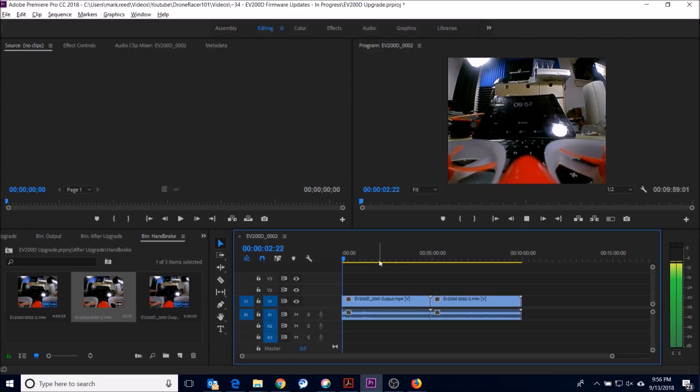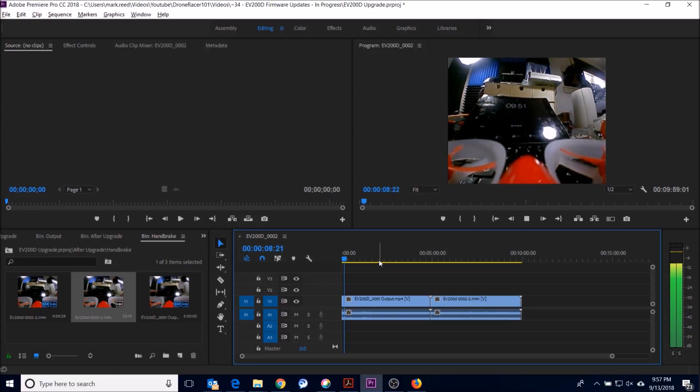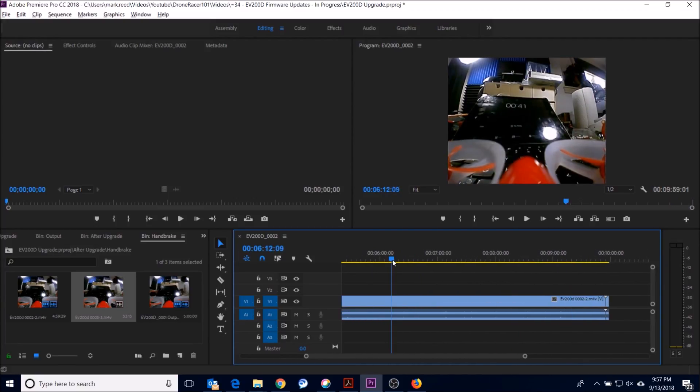A lot of people had problems with overexposure outside and this change will definitely help, but it didn't fix my problems. I did what I'll call an unsuccessful test — one of the problems I had with the DVR is it gets out of sync with my audio, and that didn't get fixed here. I recorded 10 minutes of video and at the end it was 9:59, which is close enough. But when I was out flying, my DVR didn't stay in sync with my audio. Recording a timer isn't a great test because with variable bitrate, there's not enough action — the real flying footage got off more. That hasn't been fixed with this patch.